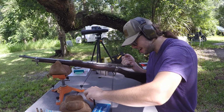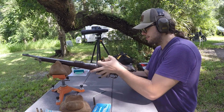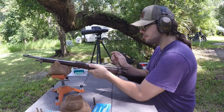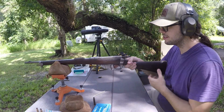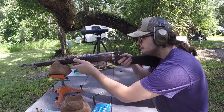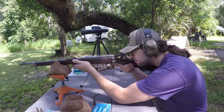I'm gonna send another one of those. Okay. Let's see how bad that click bang is. Because yeah, these primers, they're probably just completely shot. Because black powder is far easier to ignite, and if it's not going to ignite that reliably, then I'm just going to toss these, or maybe I'll set them off and convert them to boxer primed, because 303 brass is definitely more expensive nowadays than it used to be.